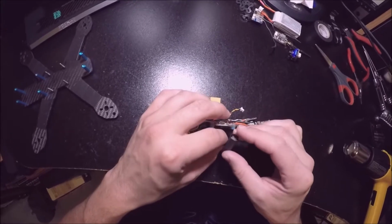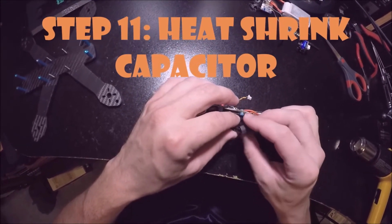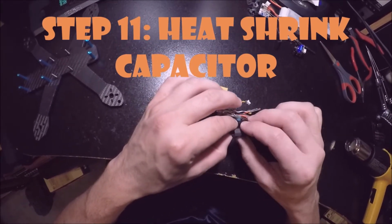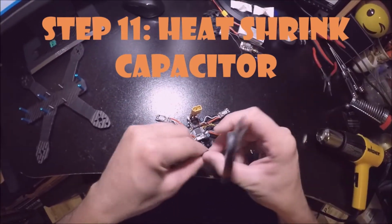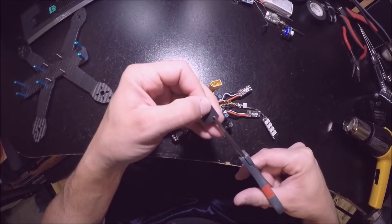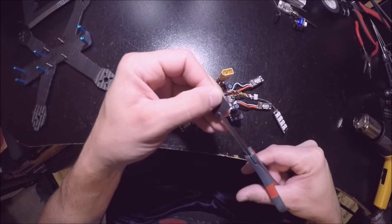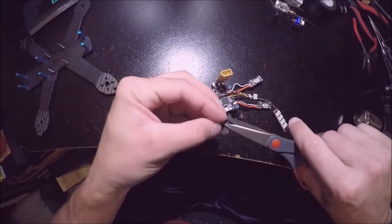Alright guys, so our next step, we're getting close to being ready to put everything in the frame. Step 11, we're just going to add some heat shrink to the capacitor. And again, I'm going to be attaching this to one of the standoffs, so it's going to be metal on the capacitor. There's also potential for the capacitor to actually come in contact with the carbon fiber. So again, I want to add as much protection as I possibly can. So I'm going to add some heat shrink on the capacitor.